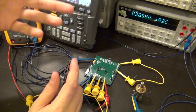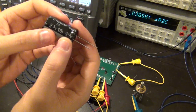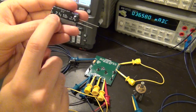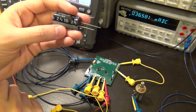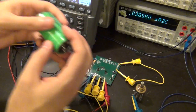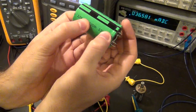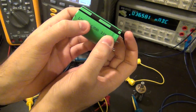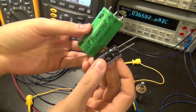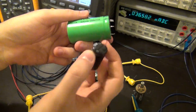This supercapacitor has a maximum voltage of 2.5 volts and a 10 farad capacitance. But I said this is not so good - it's too small. So I bought this other one. Let me hide the capacity so you can take a guess. Ready? Three, two, one - 400 farads! This guy has 40 times more capacity than the smaller one, even though obviously it's not 40 times as large. This is a newer technology. I bought this for about 23 to 24 dollars from Digi-Key - it says the total energy stored is 0.35 watt-hours, which is a lot of energy in a capacitor.